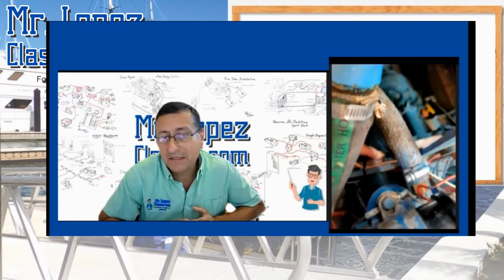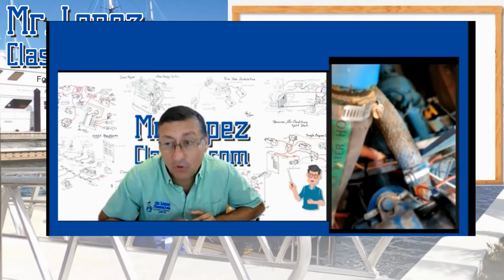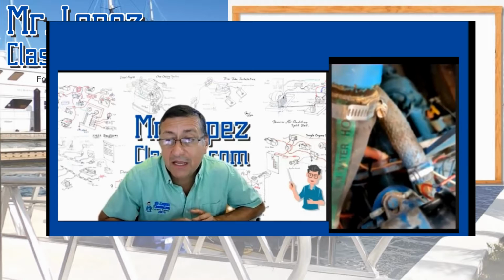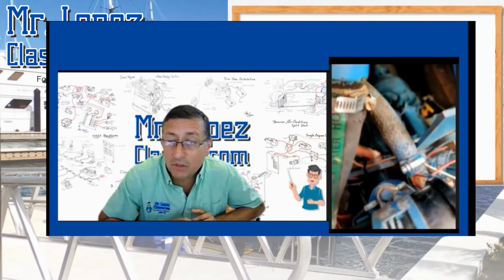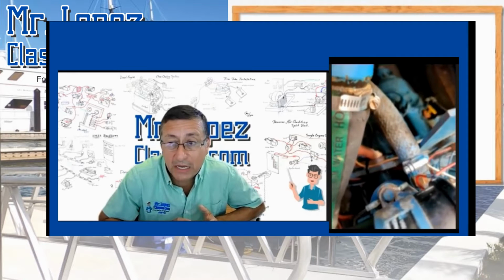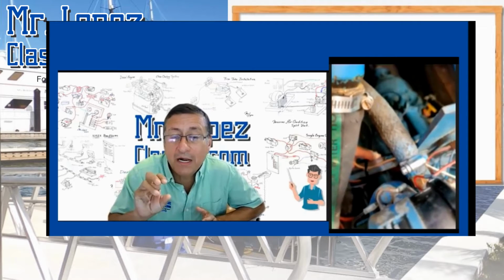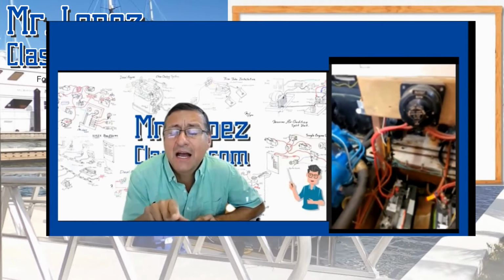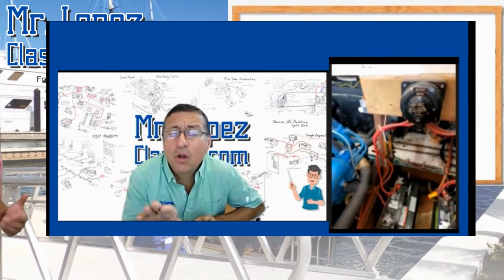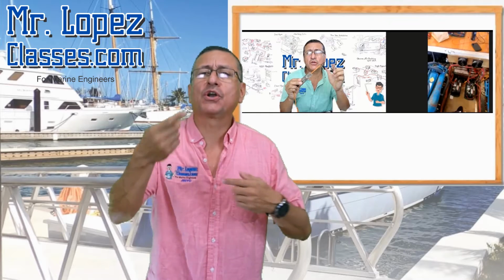We are going to install another black cable from the same negative terminal connected to the new negative bus bar that you bought a couple of minutes ago in West Marine. You put the negative bus bar in the wall in between both batteries. Exactly. And we are going to locate it in that wall. Exactly. We can work together.